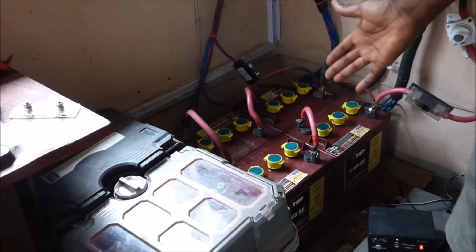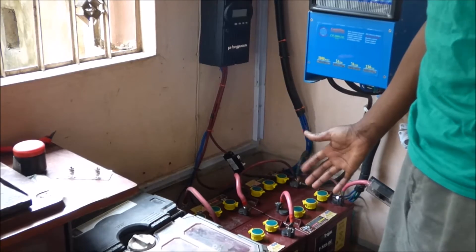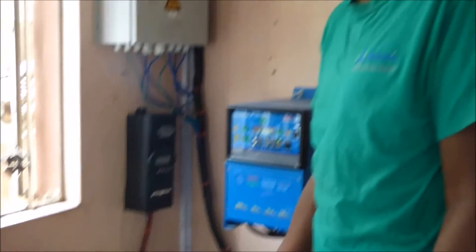It's a 6-volt battery. When you have a battery reading 4 volts, you know that battery is in trouble — it's distressed. I connected the battery desulfator, ran it for a little over a week, and the battery has maintained 6 volts ever since.